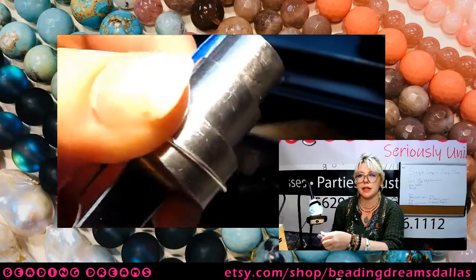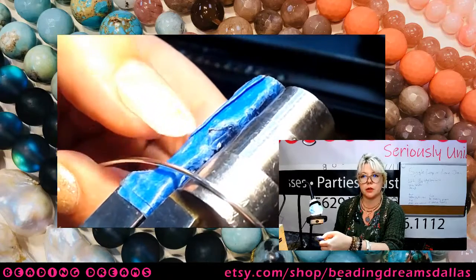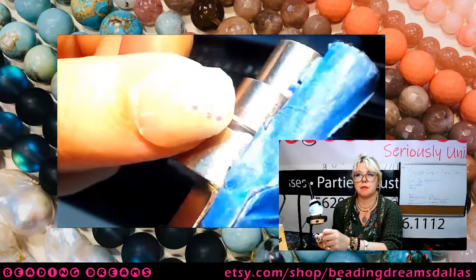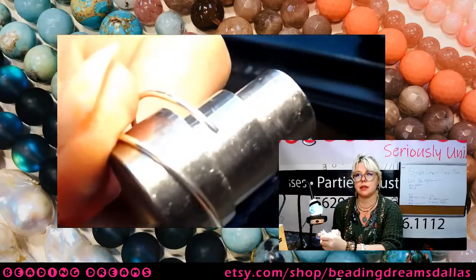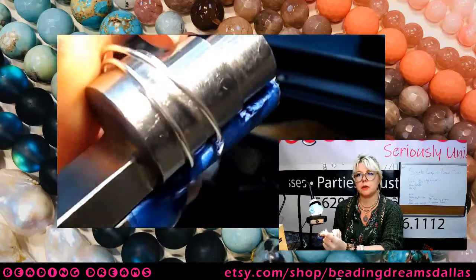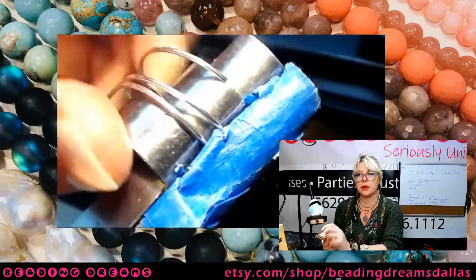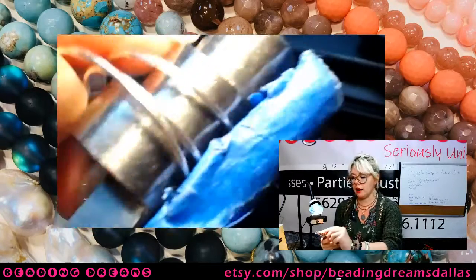Now, at some point, I'm going to get to here. I can't make any more loop because if I keep turning it, I'm going to wrap it around the bottom of my pliers, which is going to make a very ugly shape. So I'm just going to loosen the pliers, spin them back to my beginning place, grab again, and then make another coil. And I want to try and place each coil beneath the coil that immediately precedes it. So as I'm making my coils, they're progressing off the end of my pliers. That way I'm never going to run out of room.